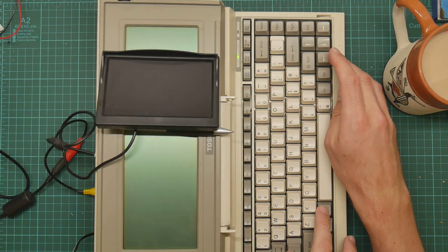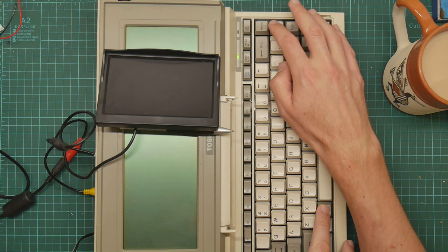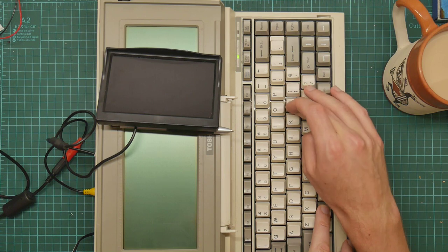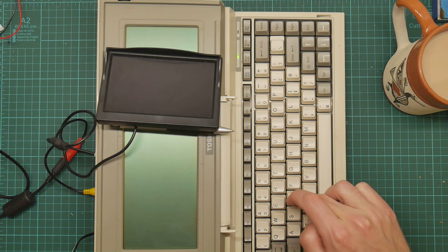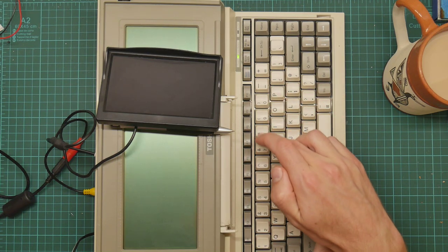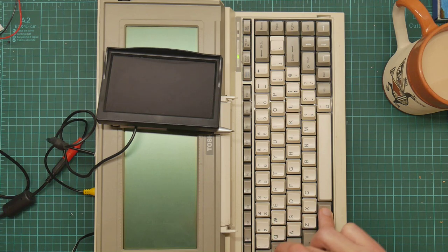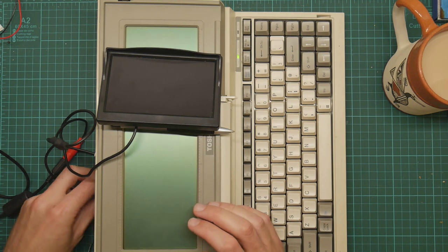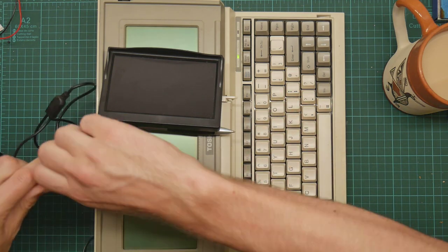The other thing is that they may need a key sequence to start the CRT, so let's just start pressing keys. I also have not heard the floppy drive chug, which usually happens. The screen clearing here is about the right time for it to attempt to boot. Sometimes you need to press the key sequence to make it switch to the CRT.